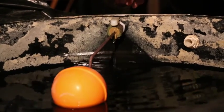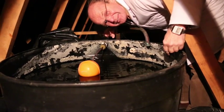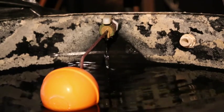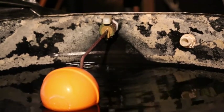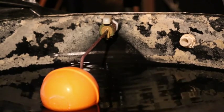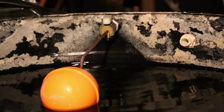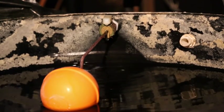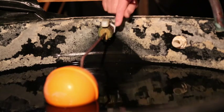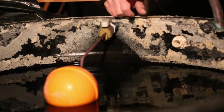Well, it's finally slowed down but it'll keep on dripping like this for hours and hours, so we'll just leave it go until it stops finally to see how long it takes. Now it's almost stopped — you can just see it's still dripping — and it'll go on like that for a few more minutes. But I think I've made the point that if you haven't got a displacement meter, you're not going to measure the water that goes into your tank, and then it won't work properly.